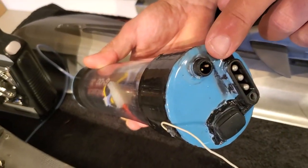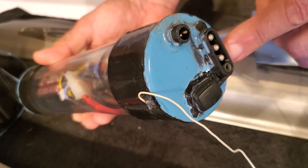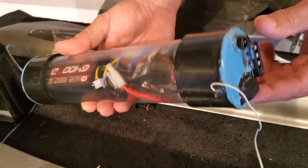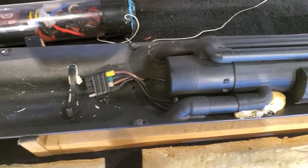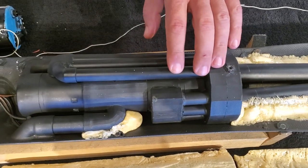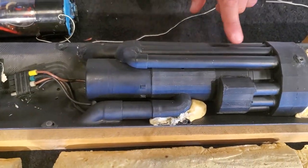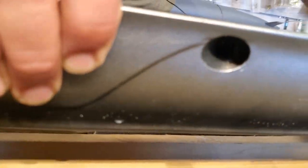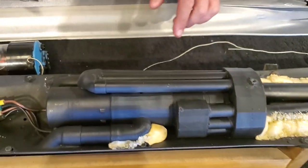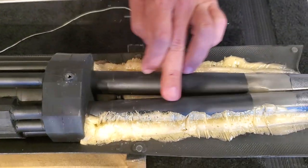We've got a lighting port that you would connect your lighting power to, and a waterproof connector for the main pumps, and a waterproof switch to turn everything on and off. Moving to the back, we've got the waterproof connector for those pumps. And we've got two Rule 1100 gallon per hour bilge pumps. And those provide propulsion for everything. And you can see this rather complicated ducting that all comes in here. But basically, you've got the intake. And that's the water is sucked in from the bottom of the boat into the pump, and then expelled through these different channels into the left and right exhaust ports.